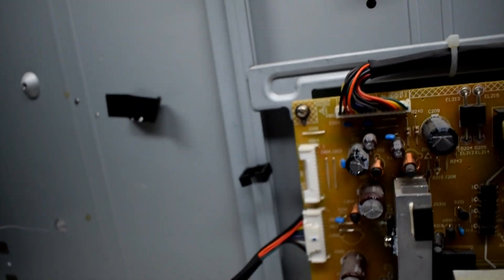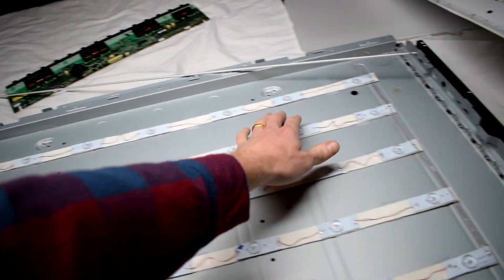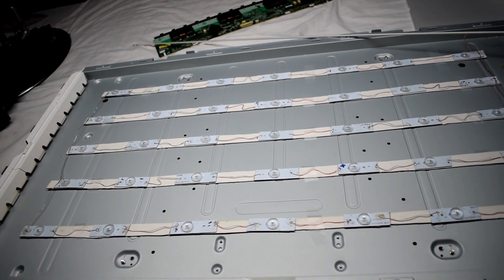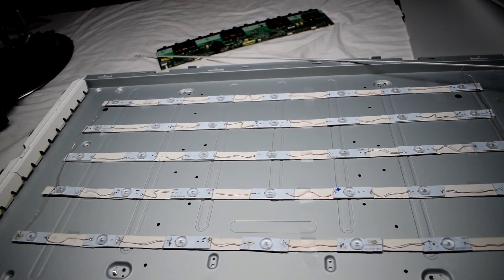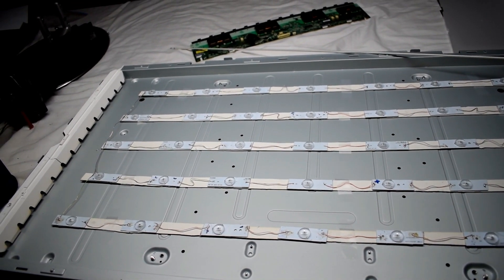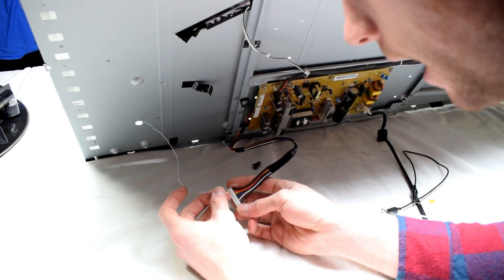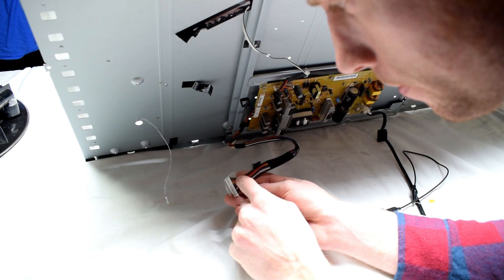It has 24 volts and ground, so I'm just going to be using the 24 volts and connecting it to LEDs. I'm putting them all in series — one, two, three, four, five, six, seven. You could put eight for exactly 24 volts, but I put seven so that's 21 volts, making them extra bright since you won't be able to change the brightness. All the positive sides of the strips are connected in parallel and all four top wires are all 24 volts, so it doesn't matter which one, and there's a common ground.